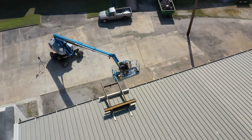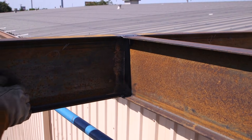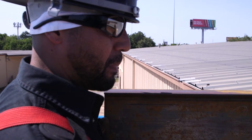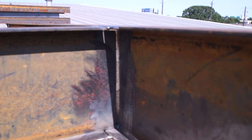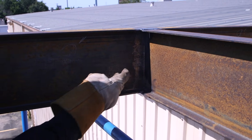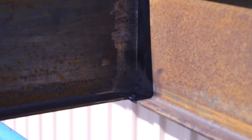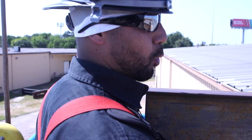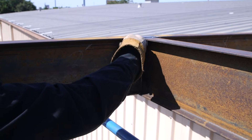We're up in heights now. We already have our coupons clean and tacked, ready to roll. We're going to start welding in just a bit. Remember, this is only a simulation. We're going to weld these two coupons — we have about a 3/32" gap in between the I-beams. Everything is going to be uphill. Always check with your procedure and your code to make sure you're doing it right. We're doing a 6010 root pass, then a 7018 cap all the way around.